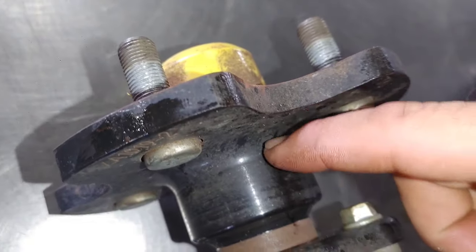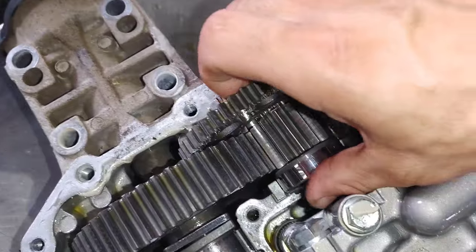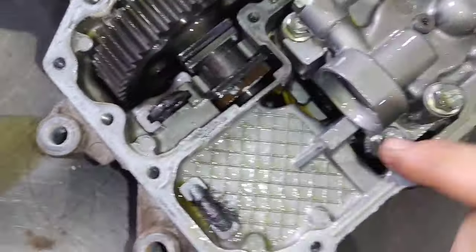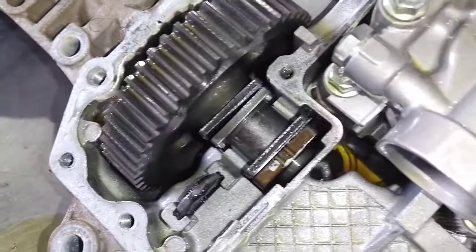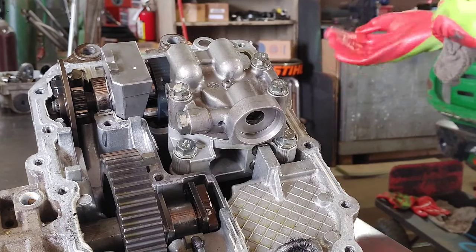If you have a later model, they used to have the hub as two pieces, but now it's a one-piece axle shaft with that hub. So you have to remove the C-clips and this gear to replace that axle shaft seal like I showed earlier. You want to keep your eye on that — make sure stuff's not wrapping around.